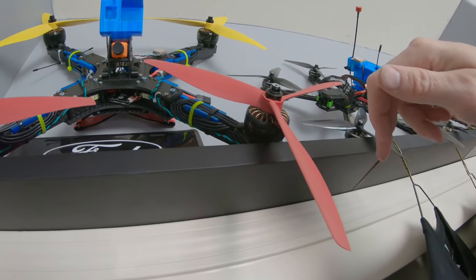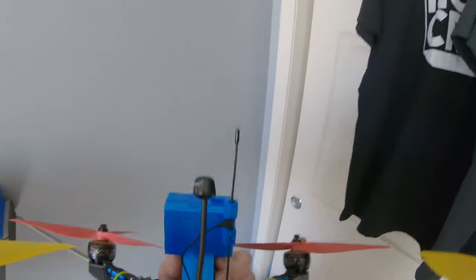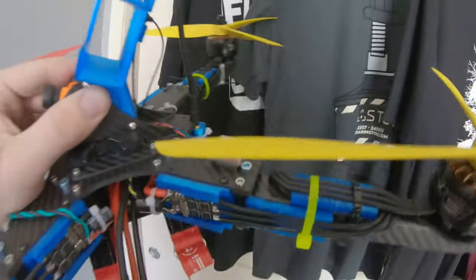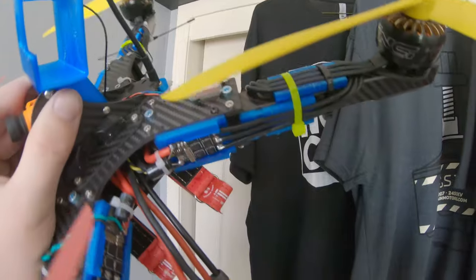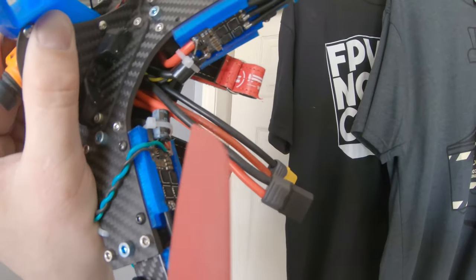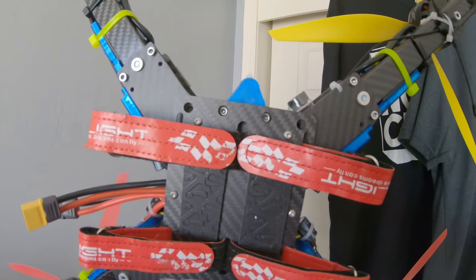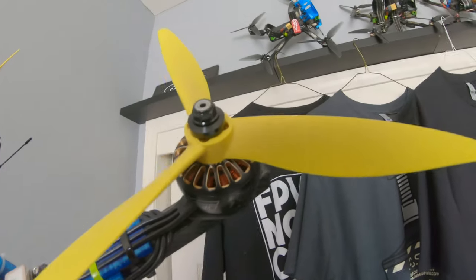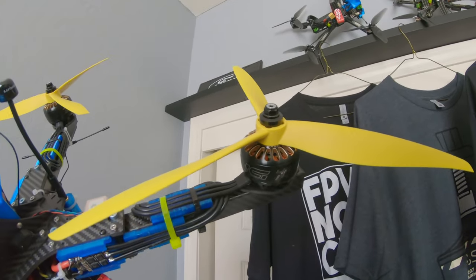It has an Immortal T holder, a better VTX SMA mount for the antenna, and GPS has been moved away from the GoPro so it doesn't get interfered with by the GoPro - it's probably still too close but it's better than having it mounted to the GoPro. Dual pigtails because I'm using 6S 2P packs and putting two of them together, making it 6S 4 parallel. By doing that, basically each row of cells in the parallel battery array is powering its own individual motor. These motors shouldn't be pulling more than about 20 amps max at full throttle.